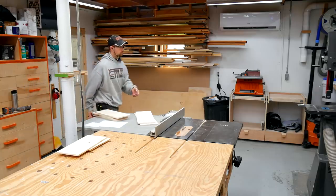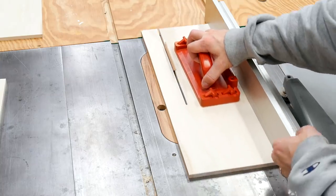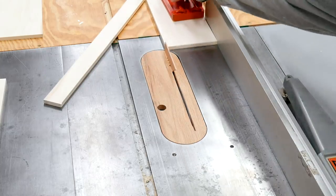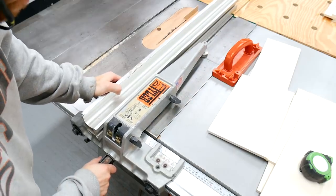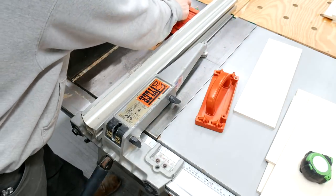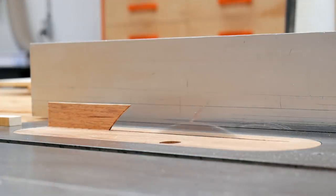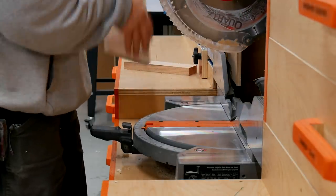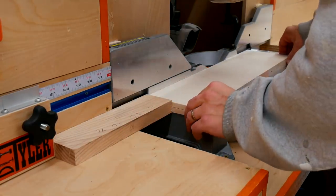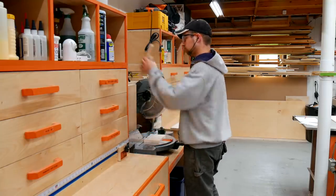Now it's time to make the shelf and the drawer. The shelf is for hanging car and tractor keys underneath on little eye hooks, and the drawer is for those knickknacks you always need when running out the door last minute. I took the maple over to the table saw and cut it down to the final widths needed for the box, taking into account the base measurements. Then I moved over to the miter saw to cut everything to final length, using my stop block with extension sticks totaling 10, 5, and 15 inches for repeatable cuts every single time.